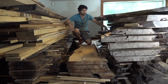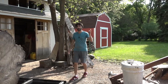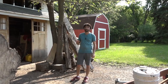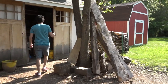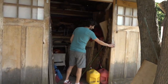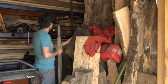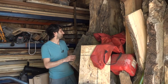They should be down around 8.5% — that's the July/August equilibrium here in the basement. Once they come out, they're ready to be sold. I try to have buyers lined up beforehand so slabs can go straight from the basement to the buyer's shop. The best time to buy and use this stuff is right when it comes out of the basement, because in the unconditioned shed space it'll start picking up moisture again. Stuff that was sitting at about 6% over winter is now back up around 10%.